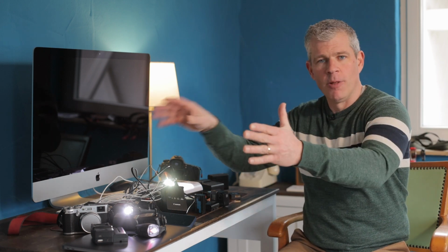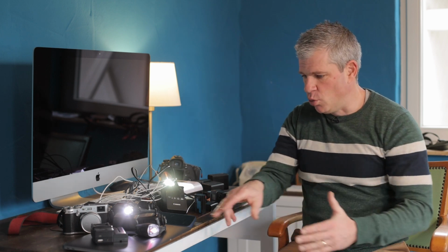I have some leftover 18 mil birch plywood. I'm going to build a carcass with a French cleat, put an oak top on it. That'll hang on the wall with some custom shelves, one specifically for my laptop. You'll recall in the last project I made, the baseball display case, I used the biscuit joiner method. For this one, I'm going to use a couple of dados, a couple of rabbets or rebates, if you're fancy, to put this together and then cover that with a Beech face frame.